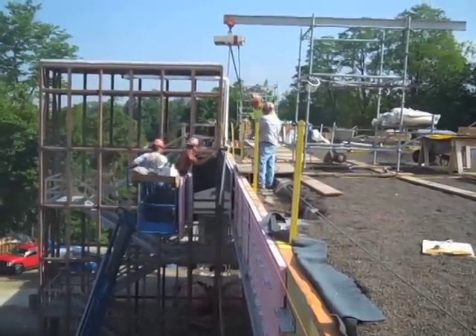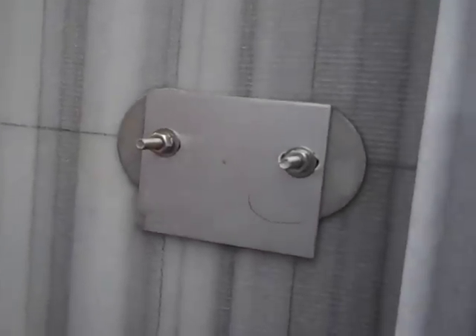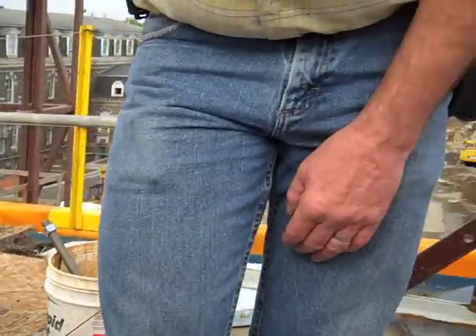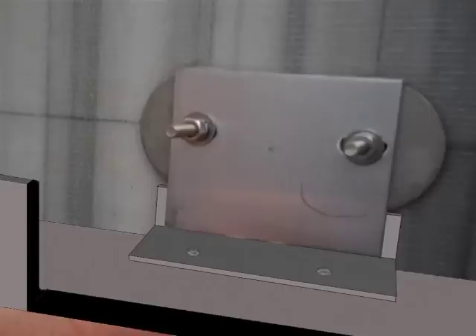Let's take a closer look at the support system. There's an angle that bolts to the sheetrock and through the metal studs, and then there's another angle that sits on top of it pointing up, that the stone panel catches and slides down onto. Special holes with reverse tapers are cut into the back of the stone panels by rotating a special drill bit into the stone. The head of the bolt is then inserted and slid up into the slotted hole so that it cannot pull out, and a metal plate is tightened against the circular shims. These shims create a space between the metal plate and the back of the stone so that the plate can engage the small metal angles attached to the clip angles that have been fastened through the fascia sheathing.